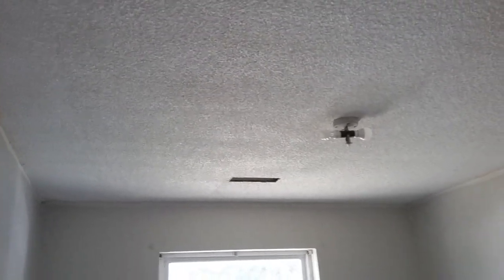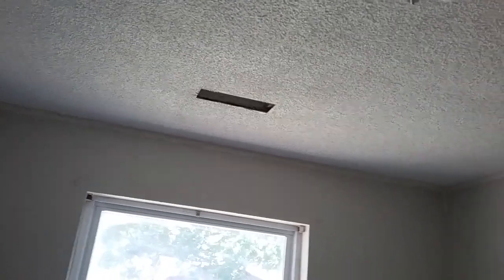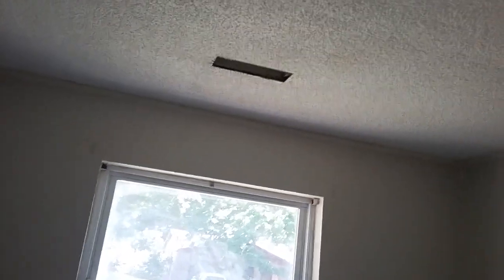Here's a tip: we're just using flat white paint, not ceiling paint. That's what a lot of professionals use for a ceiling - just normal flat paint doesn't have to be ceiling paint. The difference between ceiling paint and normal flat paint is that ceiling paint is usually a little more tacky, so when you're rolling it doesn't splatter all over. But if you take your time and don't go crazy, you won't splatter regular paint much.